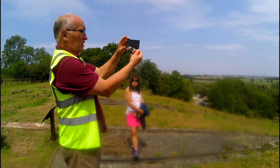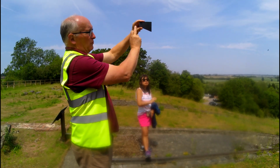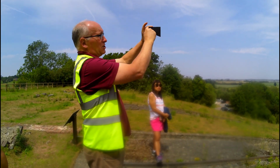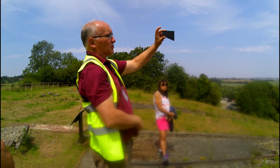Take that to be the cross-section of a caisson. The wheels lower down the slope obviously need to be lower down. These are the front wheels. He needs to keep the caisson horizontal because he doesn't want the boat slipping out or water to come pouring out.